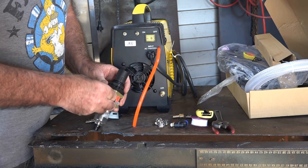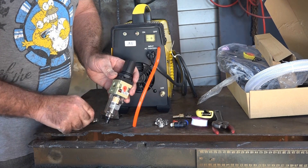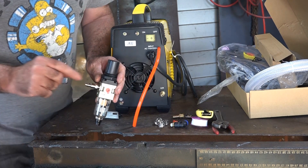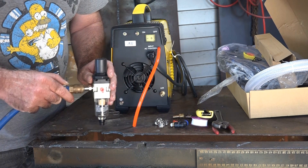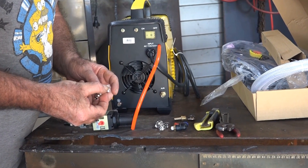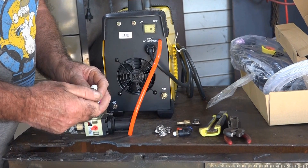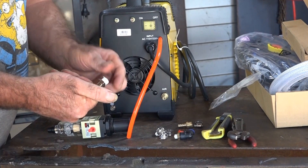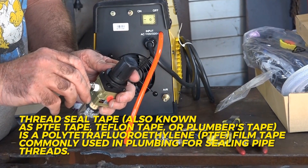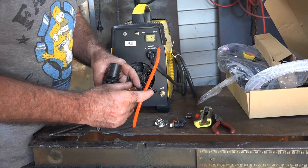If we just start with the inside, we'll just pull the plug out. The inside is going to be the direction that your air is coming from - you have a snap-on fitting here and that's what your air hose connects into in your workshop. Just grab a little of your thread seal tape guys, it doesn't take much, just enough to stop it from leaking. I find if I do it without thread seal tape it just leaks ever so slowly, so it's just as easy to run a couple of beads around it, then screw it into the inside. All it's going to be is a fitting like this because we have to put a hose on here and connect it.